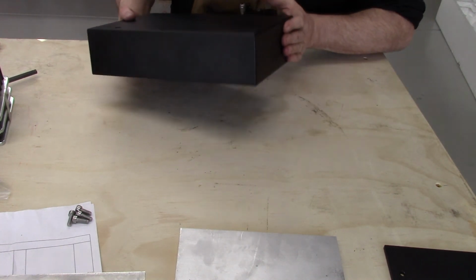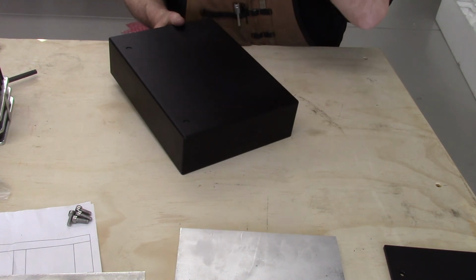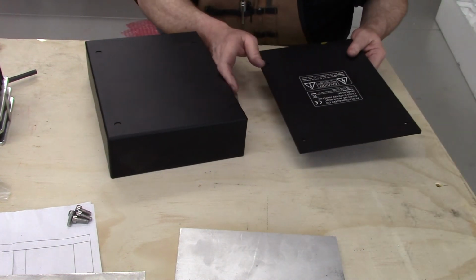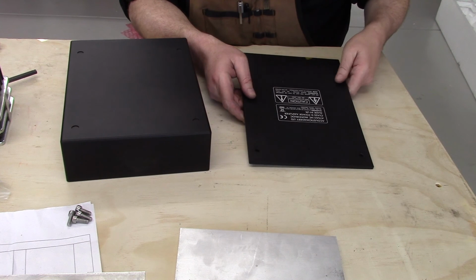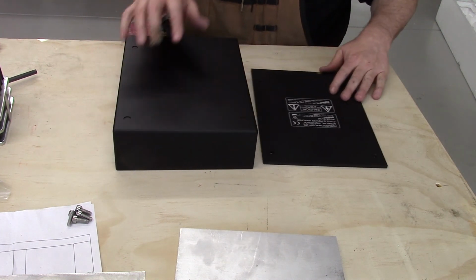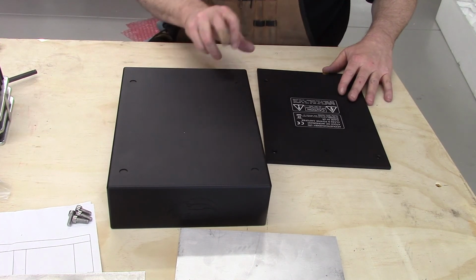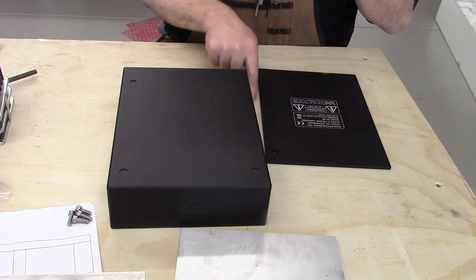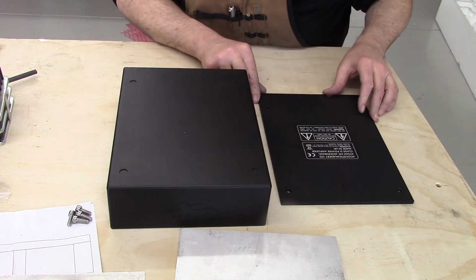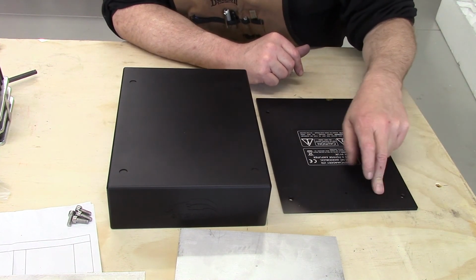The owner wants a set of holes drilled for ventilation, and this is the bottom piece of the chassis. And I'm going to, actually I'll take it back. The holes are not going to go along the front. They're going to be along the rear, 9 of them, 5/16, close to 8 millimeters, I think 9, maybe 10. I don't know, I have a drawing. And anyway, this is the bottom plate, and it will have them in its front. They correspond to the ones in the rear.